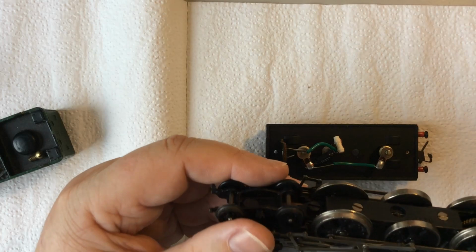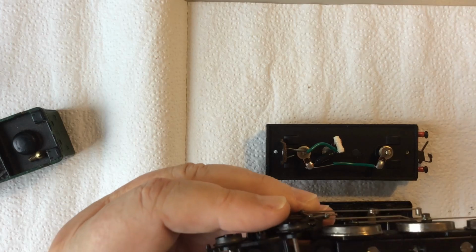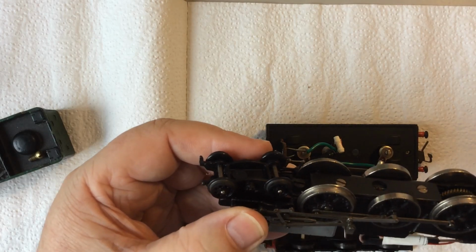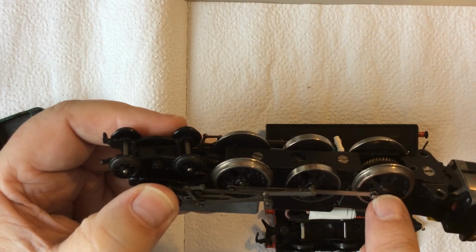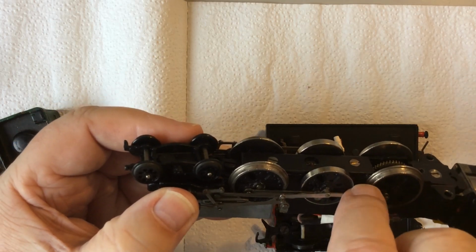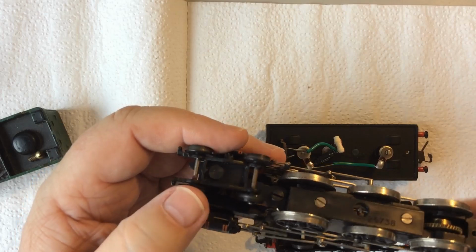It strikes me that it's possible that it could wear, because there's certainly a bit of play in the rods here, and they may well rub against this face. And even a small bit of paint in here will raise this sufficiently for the play in this to rub. So it may be an ongoing process.